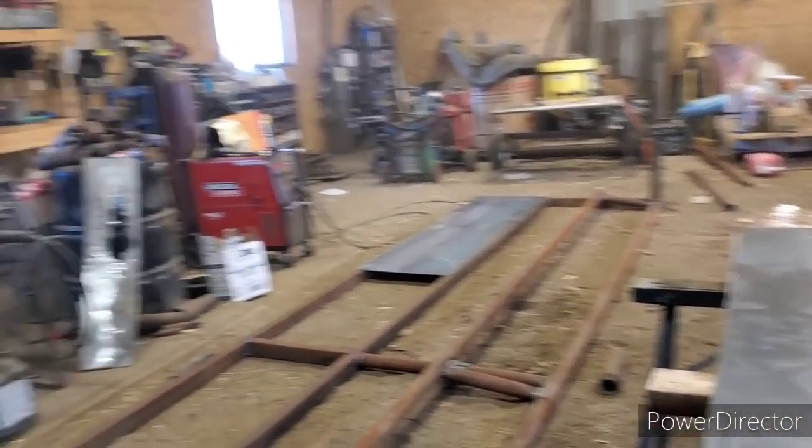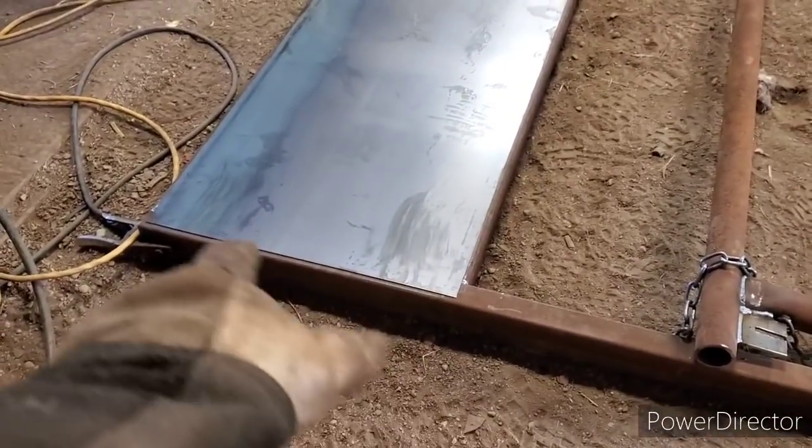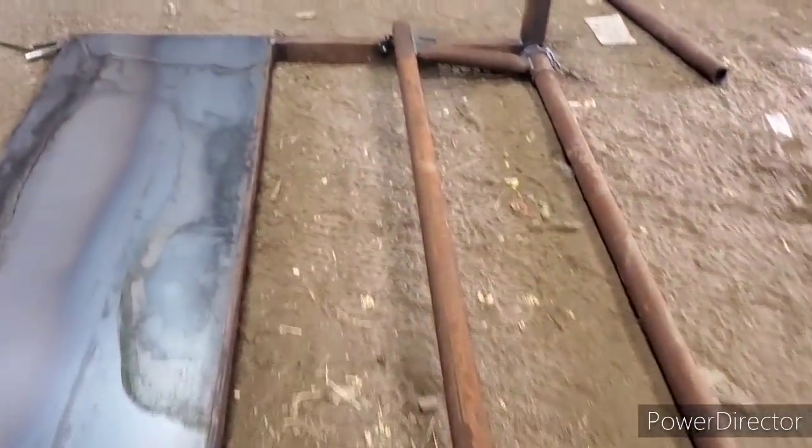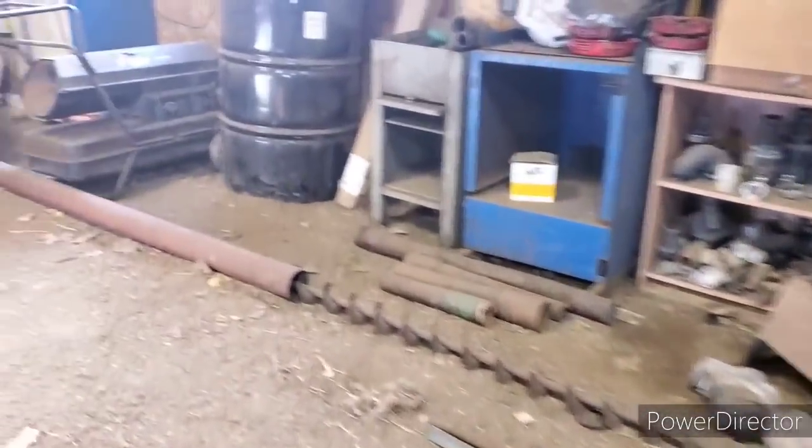My other heater's going here because the door is open — it's cold, it's minus 26 today, holy smokes. I gotta go turn my heat off here, getting hot. So I've got everything in place — these are 24 feet long so I'll go eight feet and then overlap the good joint on the outside. The four-foot sheet is underneath, and I leave a little bit of gap so I can weld the two panels to the tubing. That's just a stitch weld, make a cross and away we go. I gotta turn this heat off, let's start tacking these all together.